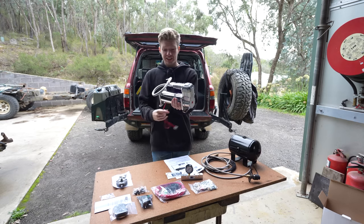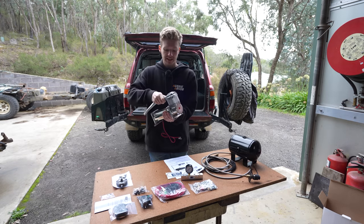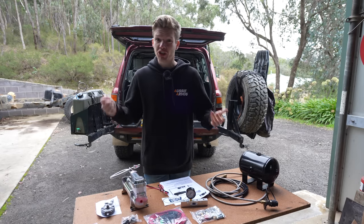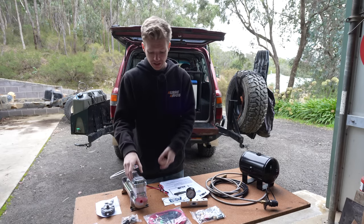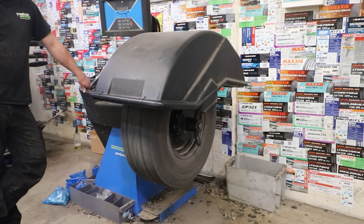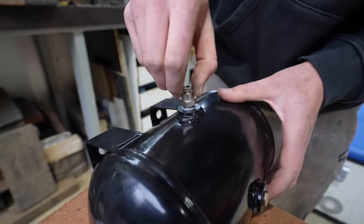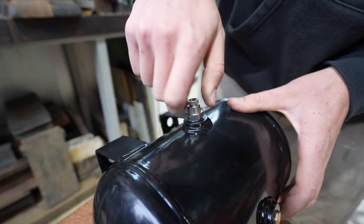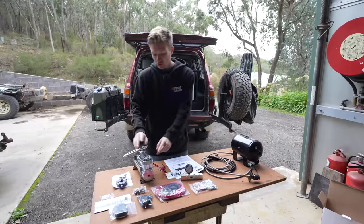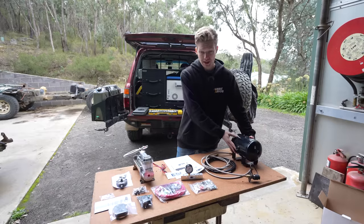Another great reason for a tank is trapping condensation. Air compressors can actually discharge a small amount of condensation during their pumping cycle. If you don't have an air tank, it's going to go straight into whatever device you're filling up — so you can get water into your tyres, which can lead to balancing issues and service problems down the line. With an air tank, you can use a drain valve to drain any water caught inside. The tank will also catch any oil the compressor might leak, keeping it out of whatever you're pumping up.